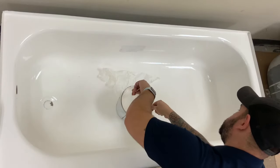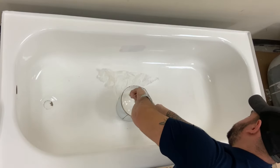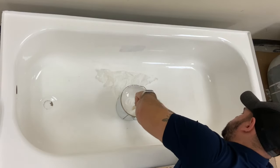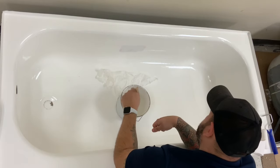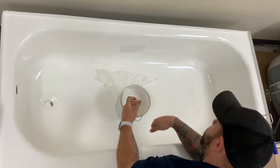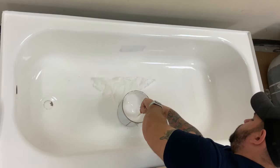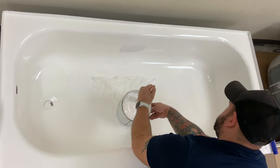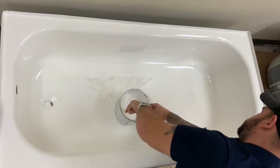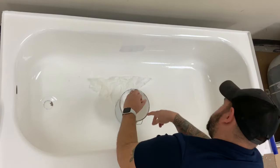So 10 minute stir - you want to make sure you're very thorough with this: scraping all the edges, digging everything in. Some people like to mix it and then pour it into another can, but I find that kind of wasteful. We promote this as an eco-friendly alternative, so making more waste and litter is not usually the best way. As long as you go around the edges, scoop all the material off, stir it up well, and scrape it off with the paint stick, you'll be fine.